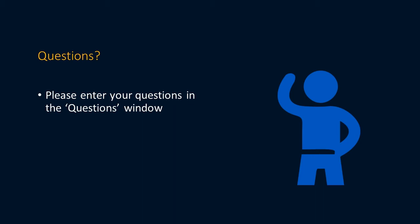That having been said, we are in the process of getting NEMA 4, or NEMA 4X actually, on these. We don't yet have the testing done and in hand to prove that these are NEMA 4X meters, but likely when we get the hazardous area approvals, you will also see us start calling out NEMA 4X. So it's an IP65 product, which likely will be good enough for what your customers need. I personally think these will have no issue with NEMA 4 because we have, if anything, improved the gasketing over our other NEMA 4X products. We just aren't there yet to back that up with the certification.